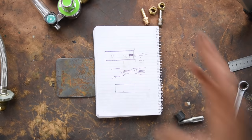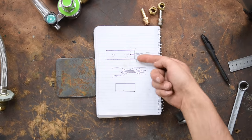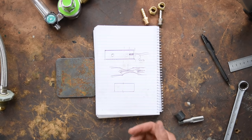Right, let's make ourselves a blowtorch. We're going to create a naturally aspirated blowtorch. This is your burn chamber or pipe, and this is your gas inlet. What we're going to do is rely on the pressure of the gas to create a low pressure zone just in front of the nozzle that's going to draw as much air in as possible through the venturi effect.